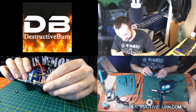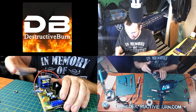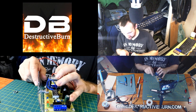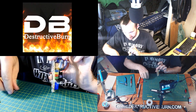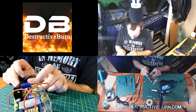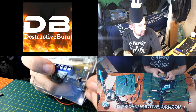Now we're putting the case together. The potentiometer may sit a bit crooked or too low — I had to lift up the solder slightly and pull it off the board just a tad off-camera to make it fit. For the front panel: screw on the large nut onto the potentiometer shaft, being very careful not to bend it since that's what's holding everything. You'll see tiny pinholes on the case where you slide the smallest screws through, then put the little nut in and screw it into place.